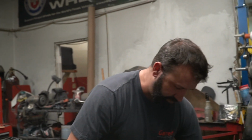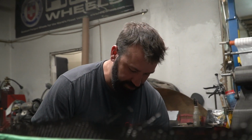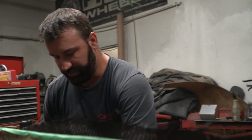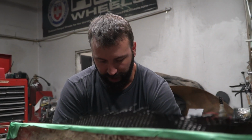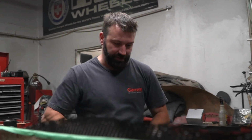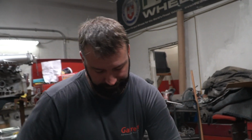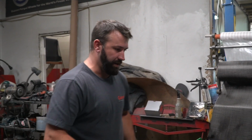But the cool thing with that is because you don't have to infuse it, you can get into some really complex shapes. Multi-piece molds that are blind, if you will. Like, my plan is to take my wing line over to pre-preg. With a two-piece mold that bolts together, do the layup, cook it, and then the wing is one piece. So that's where I'm going with my stuff.